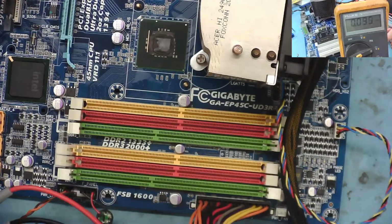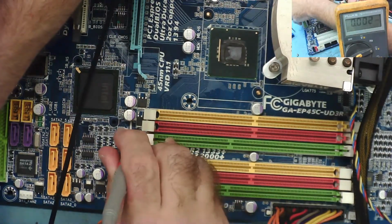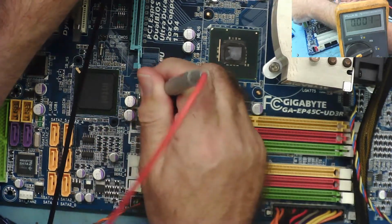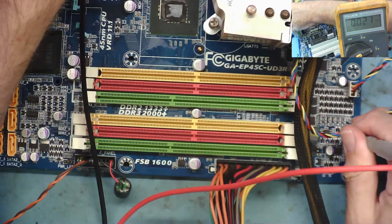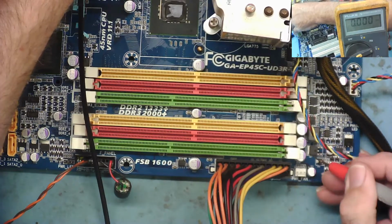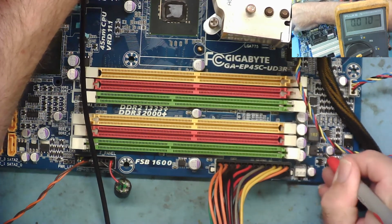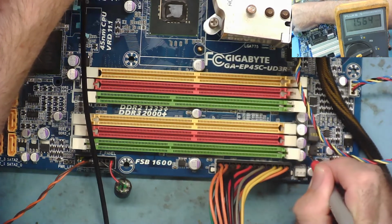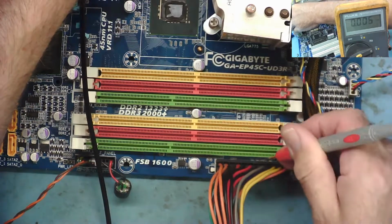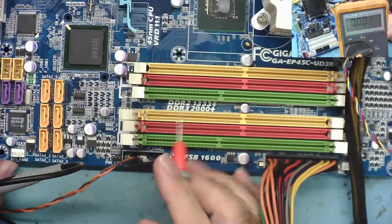Okay, let's take the resistor back out from here, so it's just got 5 volt standby on it. Let's have another look, so we can figure out what I've got on where. Now there's nothing on here, so they weren't coming from standby. Some more over here. The buck regulator. This is probably a VRAM, to be honest. 1.56. Something on that one. That's obviously got power one way, the other coming from standby. What else can we see around here? Any more? Yeah, a few more down here.